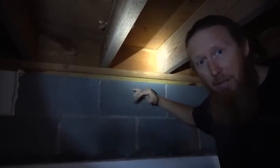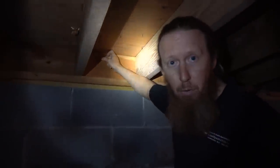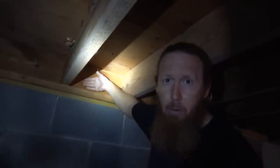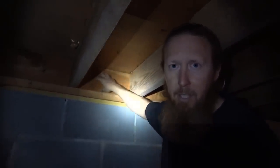If you're hiring a crawlspace professional not leaving that termite gap, you may want to ask them to do that. The rim joist is a critical area to insulate according to buildingscience.com — air will move through that gap up into the wall of your house. By air sealing this area and installing R10 termite-resistant foam board, you stop air infiltration and thermally insulate. If it's cold outside — say 15 degrees — you could develop condensation right here, especially if you don't have a dehumidifier.